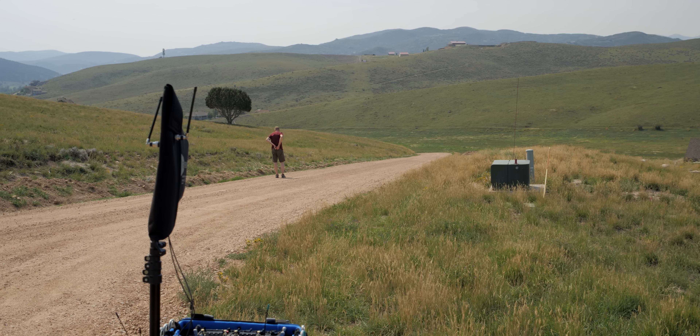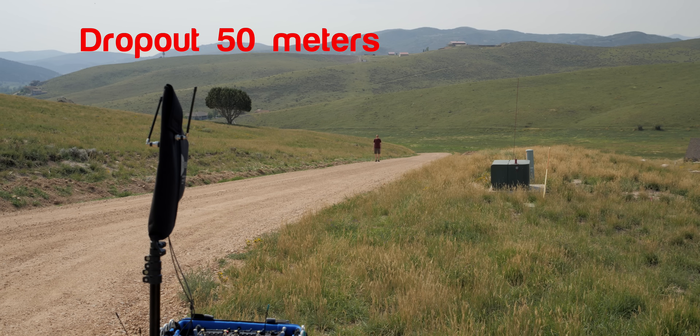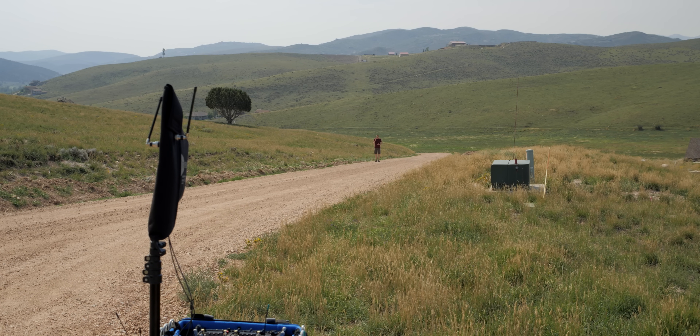Let's keep on going. Continuing to count off steps — stopping at 50 meters. I'm turned so that the transmitter is on my back, between the transmitter and the receiver. Vertical oriented antennas on both the transmitter and receiver. Turning — so the transmitter is oriented horizontally, whereas the receiver is oriented vertically. Now line of sight. Horizontal on the transmitter and vertical on the receiver. Now vertical on the transmitter. This is the same as last time. We are using the RF Venue Diversity antenna. Let's count it off, stopping every 25 meters.